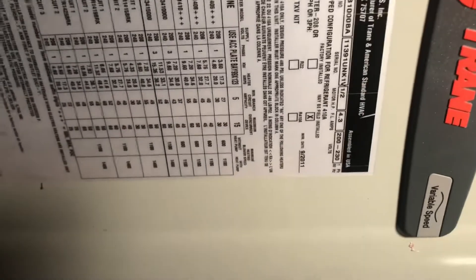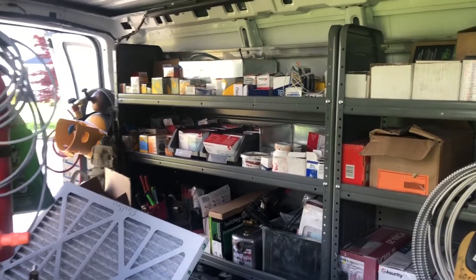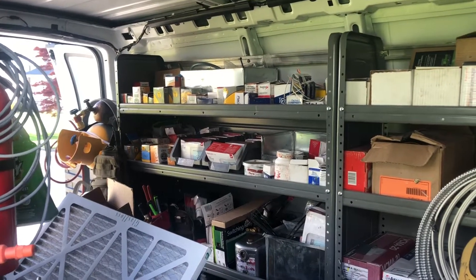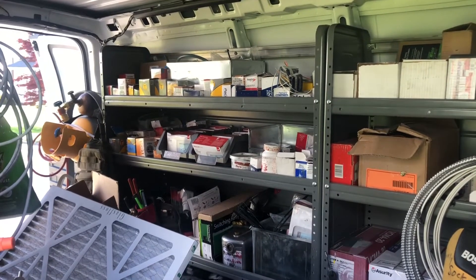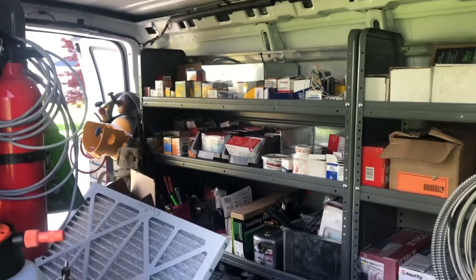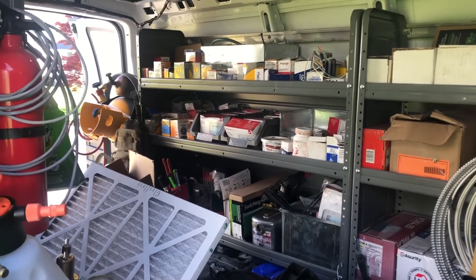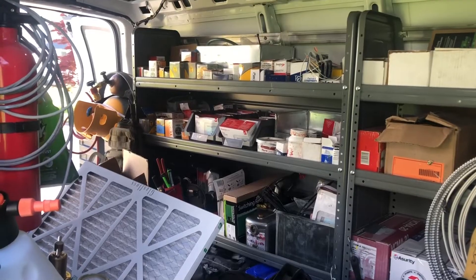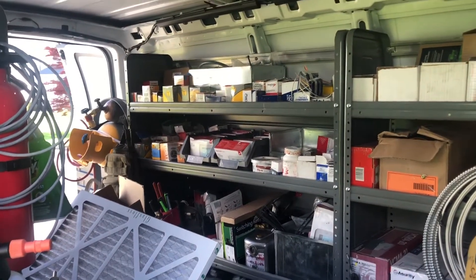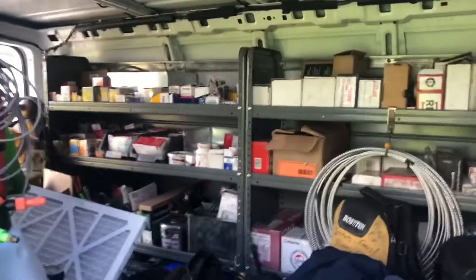It's a 2011 Trane air conditioner, three zone, and it is all set — repaired, replaced, tested. That was just a quick little video of a diagnostic and then a replacement of a zone damper. The living room zone: when the living room was satisfied and the other one or two zones were calling, that damper was supposed to close and allow the other parts of the home to cool or heat. However, it wasn't doing that — the thermostat would satisfy and instead of going to the closed position it would just stay open. You could hear the motor clicking. It was a simple fix — replaced it and tested it. Everything's working well. Thank you guys for watching, hit the like and subscribe, take care.